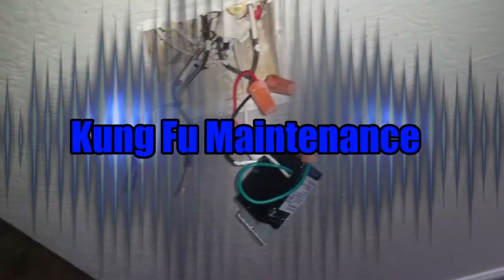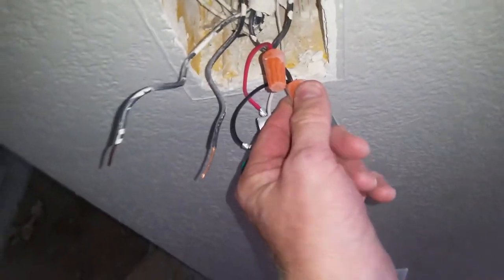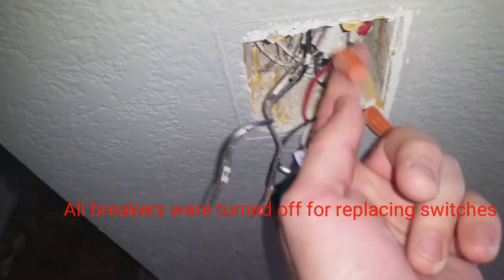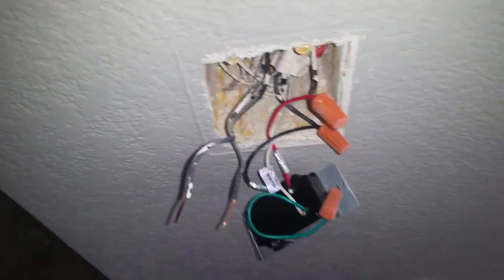The device in the occupancy sensor is with a switch — which one goes up, which one goes down. Generally, your incoming is your line voltage. That's going to be your black wire. And your outgoing is going to be the switched wire, which is sometimes red, sometimes blue.